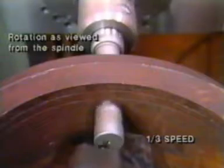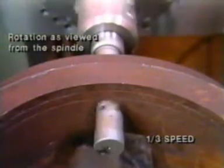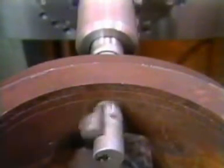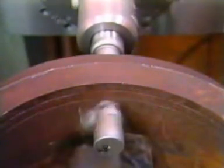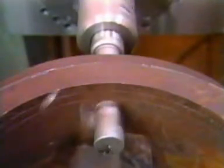Seen in slow motion, the spindle, rotating counterclockwise, clears the hole until the guide tang is beyond the edge of the bell body. Spindle direction is then reversed to extend the wing by centrifugal force. Feed is applied to begin backfacing operations.